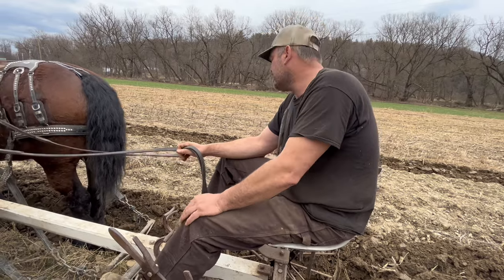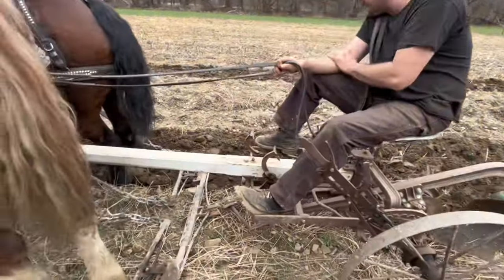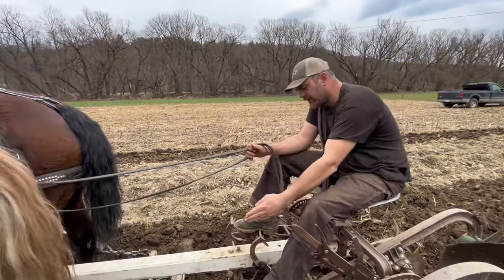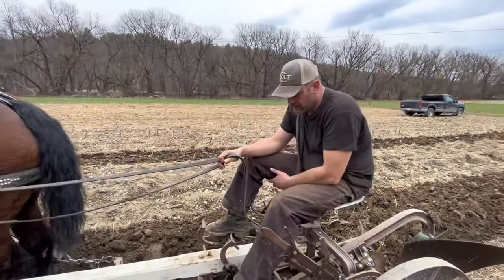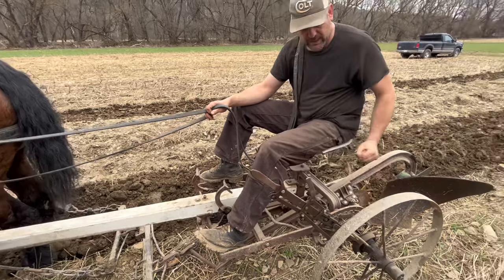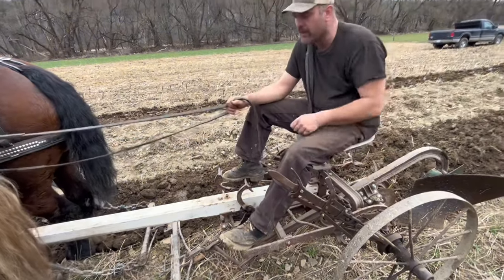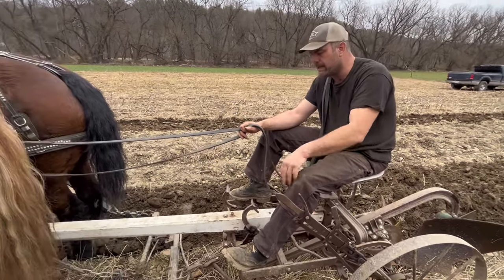But well, this is a 12-inch bottom plow. So the furrow, where Elvis is standing, is called the furrow. That should be 12 inches wide. And we achieve that by having the right width eveners and these horizontal hitches here. And we achieve depth by these levers, how deep I set the plow, and I level it out with this land wheel, and these vertical points here. And also how close your horses are hooked to the actual plow beam.